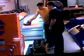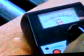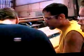The guitar body of a Les Paul is mostly mahogany. It's used for structural stability, but it's wet when it comes through the door. That's the problem. Wet wood leads to warping, and warping leads to imperfect sound. So first we lower the percentage of moisture carefully. We don't want the wood to turn and to curl and all that kind of stuff. We want it dry so that it's always going to be straight. So you're looking for a goal of 10% or 10% under is what you're looking for.